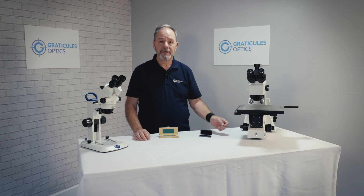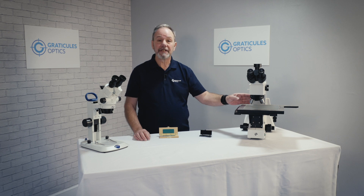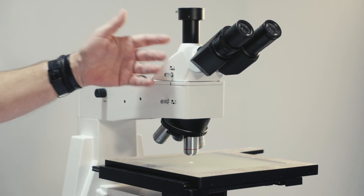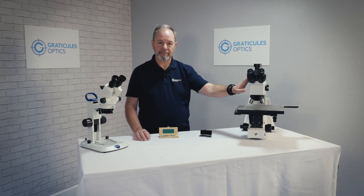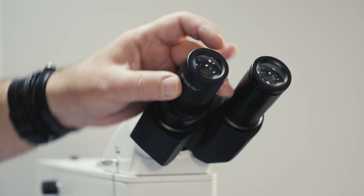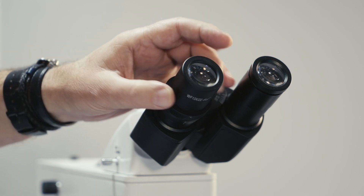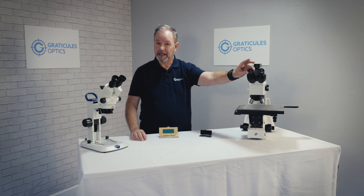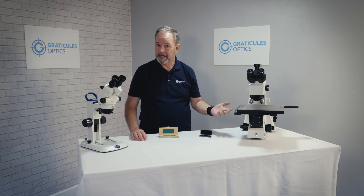Let's explore the components of a microscope in a little more detail. Here are the objective magnification lenses with an optical path leading to the eyepiece lenses. Inside this optical path from the subject stage is a prism which allows me to view the object from overhead at a comfortable viewing angle. In the eyepiece is a location to install a measurement reticule. This is normally positioned before the eyepiece magnification lenses, and it is this measurement scale that we need to calibrate to verify its accuracy.